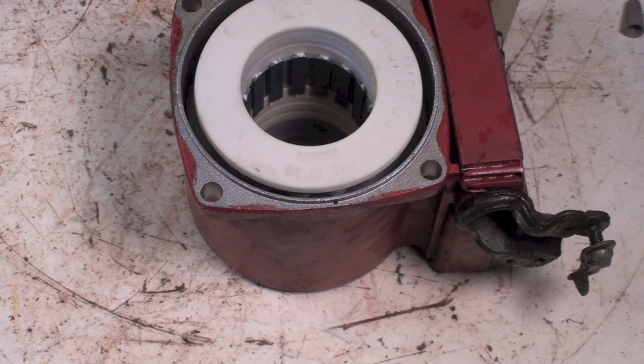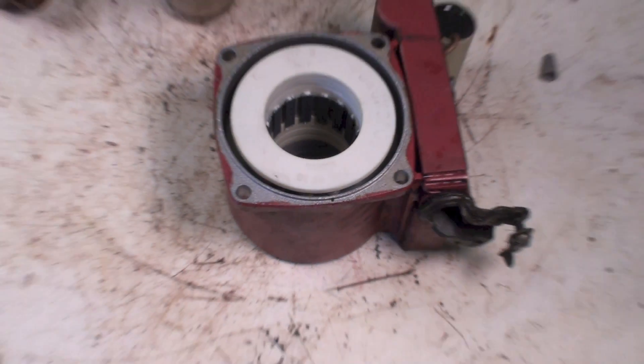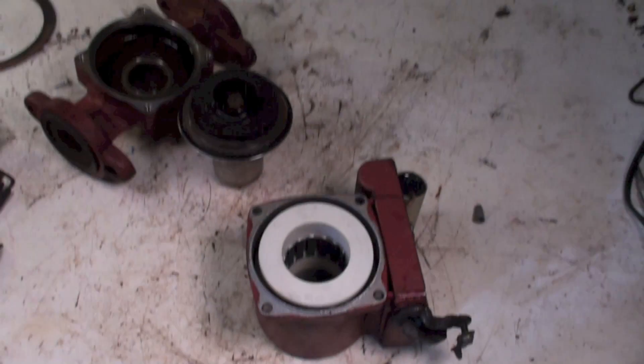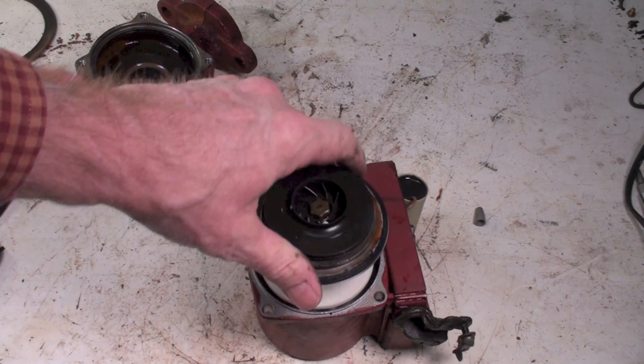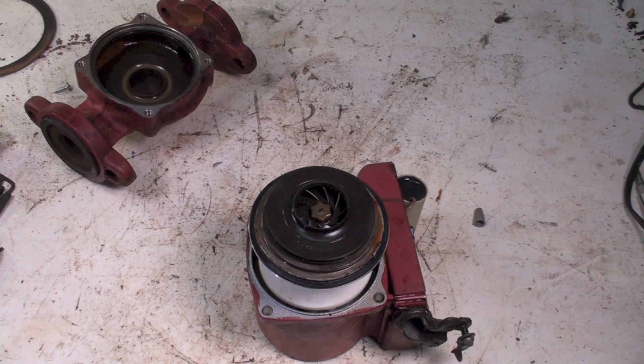They put a plastic cover on the windings. These pumps are pretty well made and I've got no real complaints about them. This actually fits tighter down onto the stator than the B&Gs do, and of course it's kind of cool because it's got the built-in check valve.